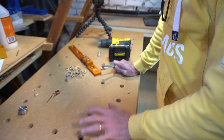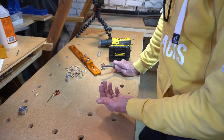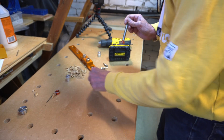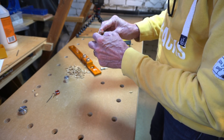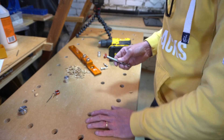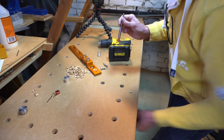When you're drilling the top, it's better to have a spacer underneath rather than another board. When I made this top I had the old top off the bench underneath, so the drill bit was going through this board and slightly into the board underneath, taking the top off the board below. Every time I brought the drill bit back through I ended up with a little MDF washer stuck in there, which slowed the process down. If you have a little void underneath so you can plunge straight through, that's better — though I was trying to avoid breaking out the underside of the hole.